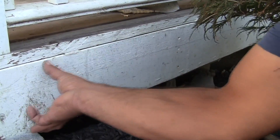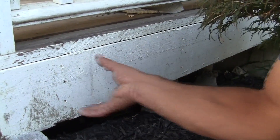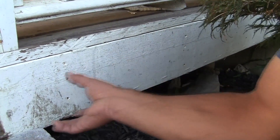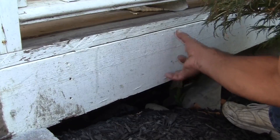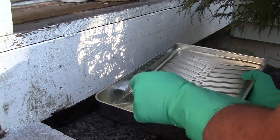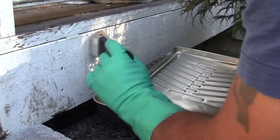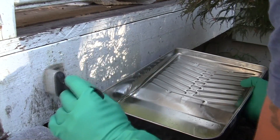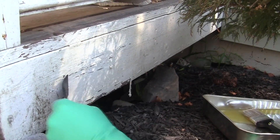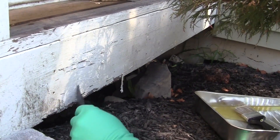A deck here which has been painted would need to be chemically stripped. But before removing it with the stripper, it's advised that you scrape as much of it off as you can with a plastic or wood scraper. When applying a chemical stripper, make sure you apply liberally and go in with the grain. Then with a plastic scraper, you can scrape away some of your paint. You will have to do this a few times.